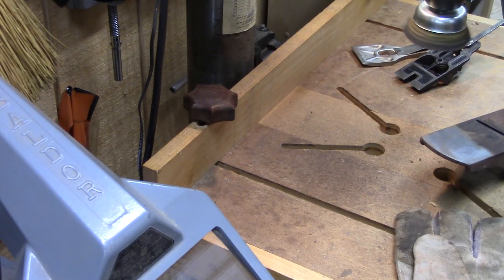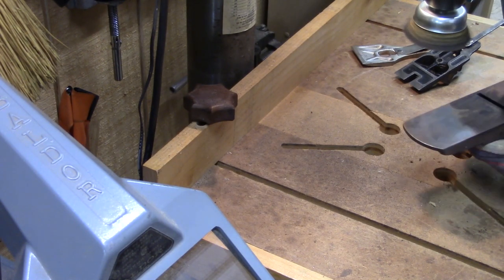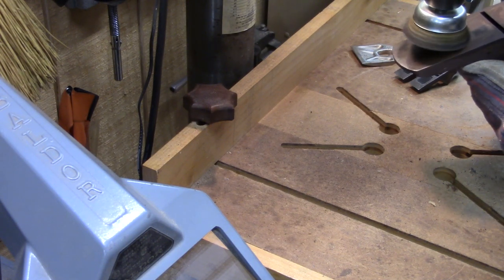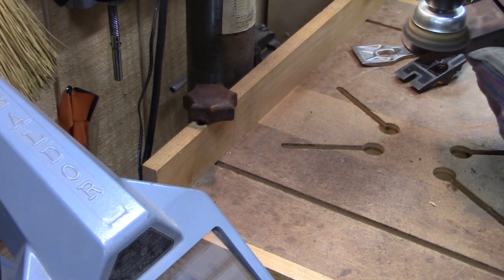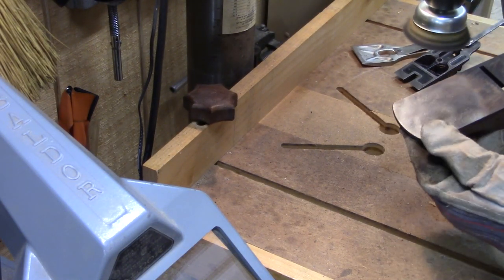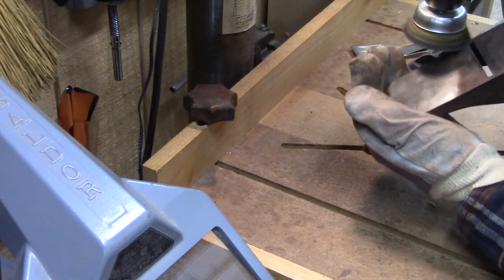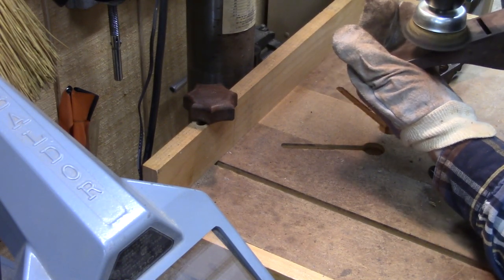Okay, I wanted to show you how nicely the sole is cleaning up with this wire brush. Just working on it's actually quite good, and probably the next step I'm going to do is flatten it with either wet dry sandpaper, adhesive back sandpaper on a reference plate on a granite surface.